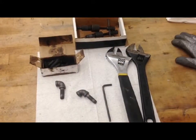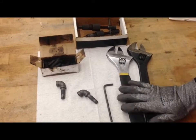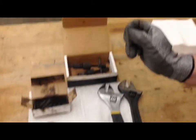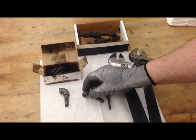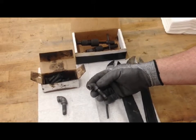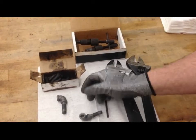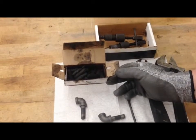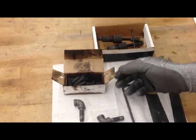Here are the tools you're going to need to grease a valve. You'll need a couple of crescent wrenches — not pipe wrenches, crescent wrenches; the right tool for the right job. You may need a quarter-inch Allen wrench. It's also good to have eighth-inch pipe nipples and elbows on hand, pre-filled with grease. The grease that goes in there is called ground key valve grease — it's a Mueller product and the only kind of grease that should be used in the grease guns.